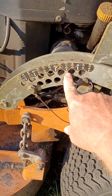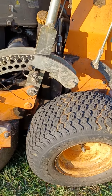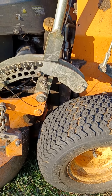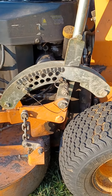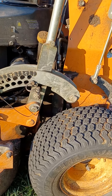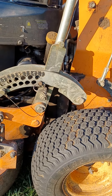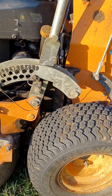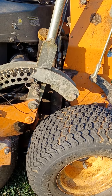Then I'll go to three and a half. Those are the only three settings I have: three and a half, four, and four and a half. I don't go any lower than three and a half because over the years I find that there are bumps in the ground, in the turf. If it's any less than three and a half, you will find those bumps and it will scalp your turf. Then the customer gets upset. I don't go any less than three and a half.